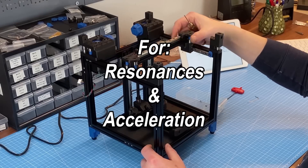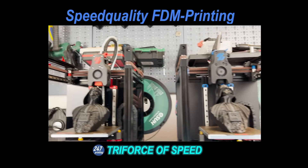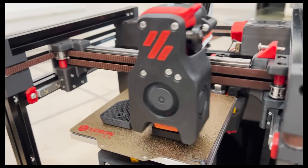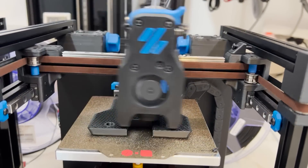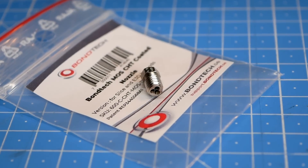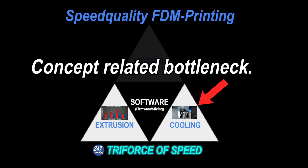The performance of the motion system mostly depends on your efforts for build quality. FormBot gives you the choice for high flow, which only provides a theoretical advantage. After printing different scenarios, the gains in printing times using the stock 0.4 mm nozzle are not decisive. The Voron 0.1 whole concept — being small scale and built to specification — does not profit much from extended extrusion flow rates. If you want to print with bigger nozzles at higher flows, you can just go for CHT nozzles as a reasonable first upgrade. The part cooling performance of a stock Voron 0.1 is absolutely okay, but in the end it is the true bottleneck — equally for both kits.